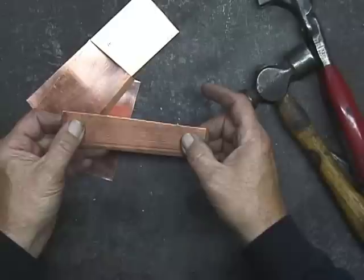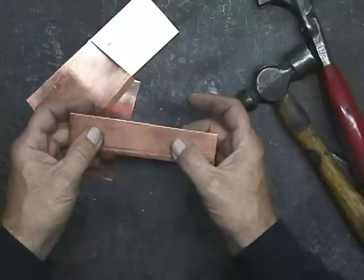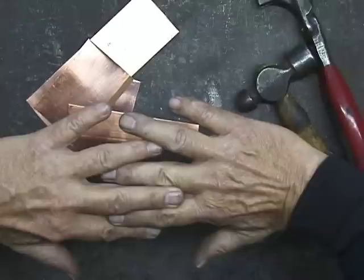When you're working with copper, if you hammer it, form it, bend it, twist it, any movement of the copper changes the internal structure. In other words, the more you hammer or bend or form, the molecules in copper go together like this. And the more you hammer and bend, the tighter and tighter they get until the copper becomes so brittle it'll just fracture.